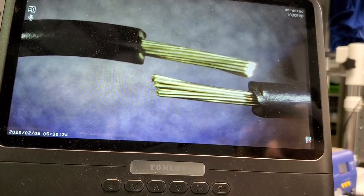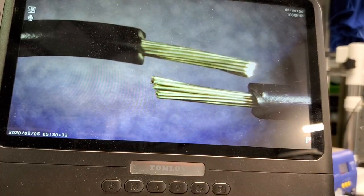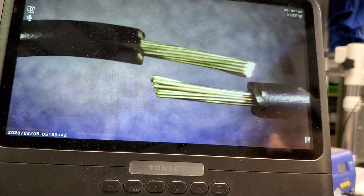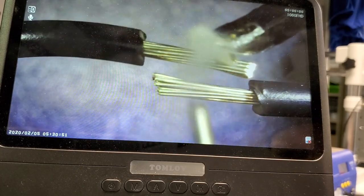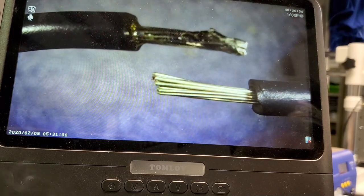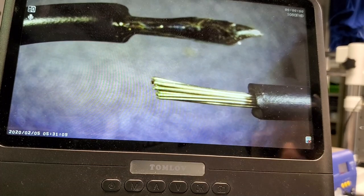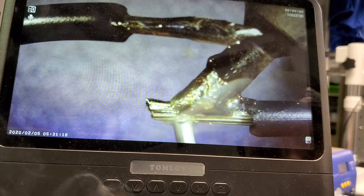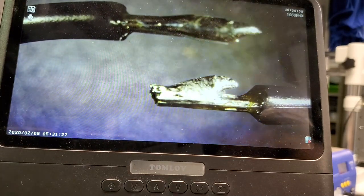The first thing I'm going to do is tin the wires, starting with this back one. Always clean the tip, then tin your soldering iron, and clean it again. When you're tinning, don't move the soldering iron at the beginning — put it around the wire, put a little dab of solder on your iron to contact the wire. Once it turns liquid, that's when I'll run it down the wire. I leave that little glob of solder on there by slowly pulling the iron away — that is essential for this method.